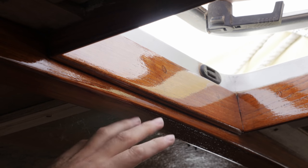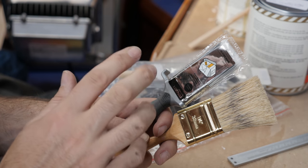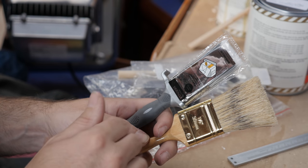I've got about three coats on there now, and it's starting to look reasonable, but I think I still need about two coats more to get the finish I want. Lots of people have tried to convince me that applying varnish is difficult and hard to get a good finish — that's simply not true. It does require a structured approach and a bit of patience. The first thing I've learned is that controlling the thickness of the coat you're applying is crucial — too little and you'll get dry spots, too much and you'll get runs, and of course that's much more pronounced on a surface that isn't horizontally flat. The second thing: when it comes to choice of brush, a not-too-soft brush that doesn't leave its bristles in the varnish is all I need — synthetic or natural, it doesn't seem to matter much to me.